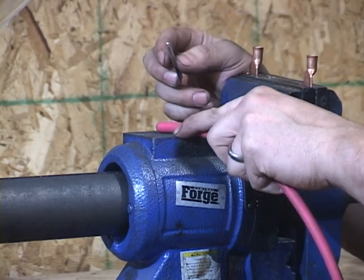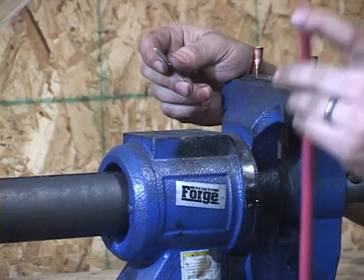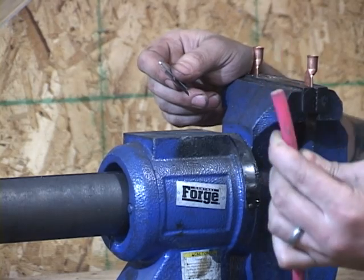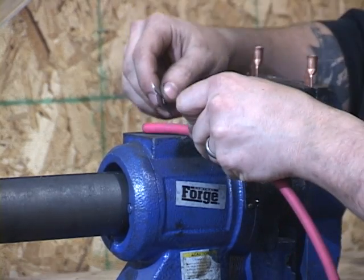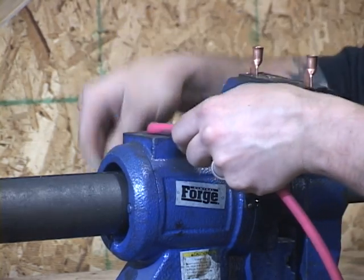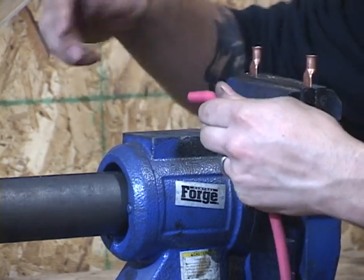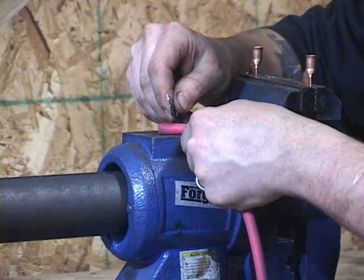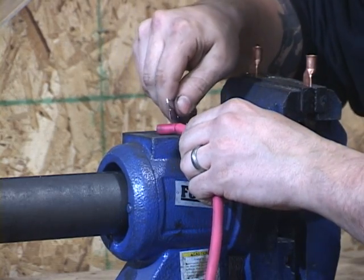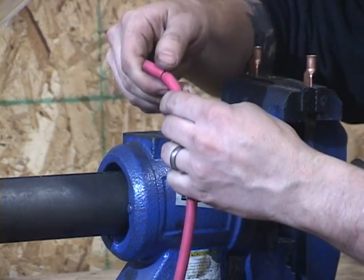The first thing you're going to want to do is strip the end of the wire. Now, the factory will tell you that if you cut even one of these copper strands, the wire is no good anymore — but we don't really believe that, so just do the best you can not to cut the strands. To do that, gently press down with the razor blade and roll the cable over — you'll cut just slightly and won't cut through the wire. After going all the way around, slide it lengthwise, and there's very little danger of cutting any of the strands doing that.